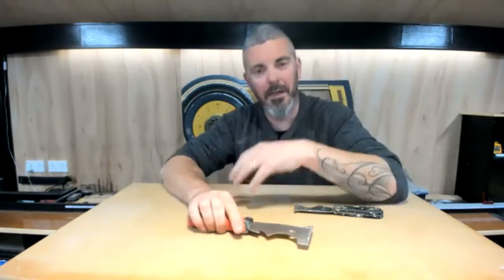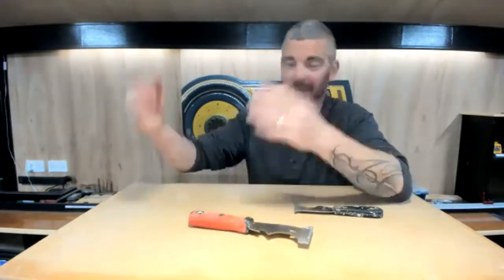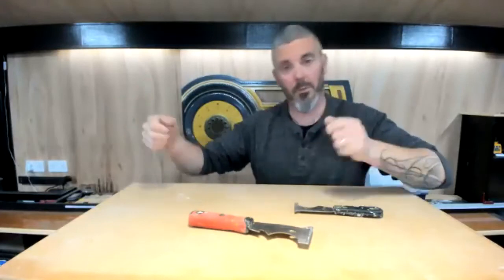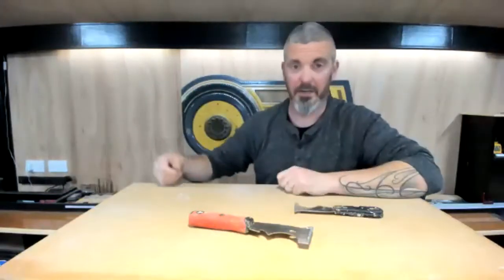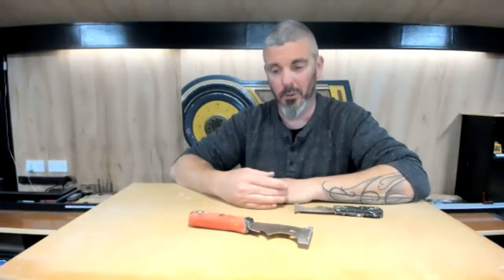I would never paint a wall without at least rubbing the wall down and checking for lumps and bumps. You'd be amazed how things just seem to grow over the years. Stains. There's always stuff. I would never just say I'm going to paint that wall today, move the couch, get the paintbrush and start at it. You have to prep the wall. It's like anything: a good foundation is a good finish. So you rub down the wall.